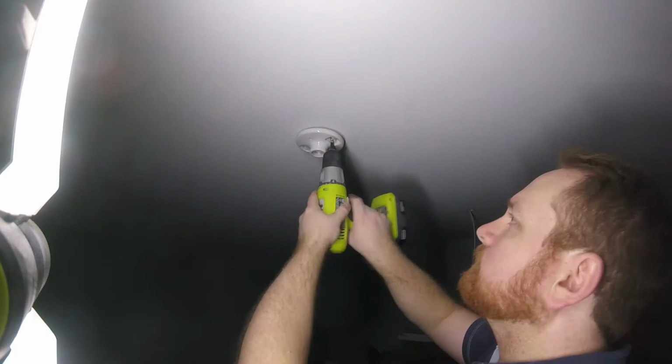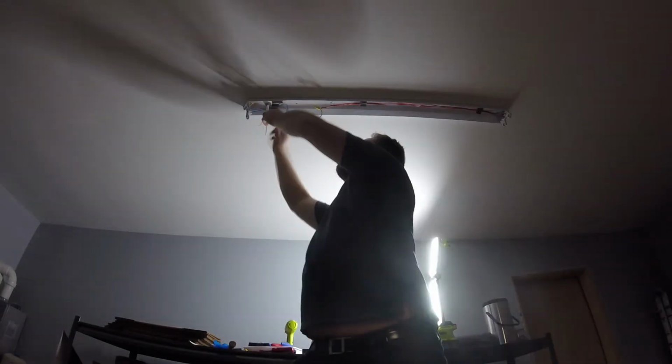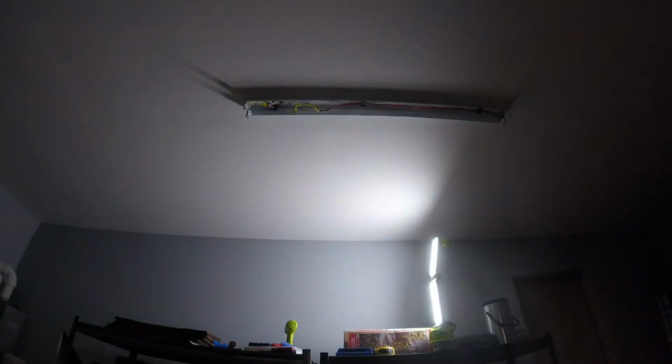I do checks frequently. Every time I get a new light wired in, I test it out, and if it doesn't work, I check the wiring. This makes sure that I don't get ahead of myself and have a bunch of connections to check all at once. The fixtures are all attached using drywall anchors, and they go up really quick. I got all of them installed over 2 evenings after work.